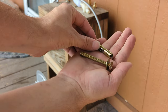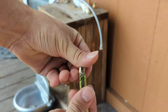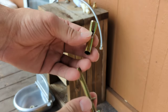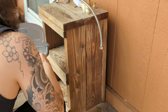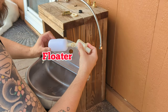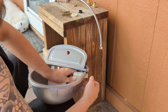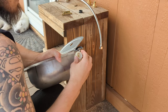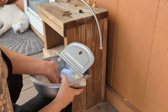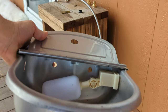So this is that screw thing I was talking about — it's a countersink screw, I believe. You want to make sure that you put this in this way, where it kind of pushes it open. You want to use your washer as well. I started with putting this little bobber piece inside of the bowl, then you take the little plastic ring and just hand-tighten it on there. It stays pretty tight with just your hands. The bobber lifts up and down, and that's how it stops the water from coming out.